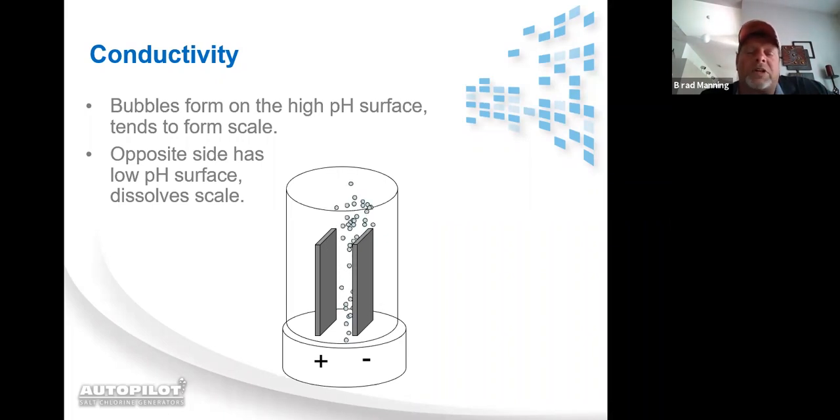So it is normal for a cell to get slightly calcified when manufacturing chlorine, like what you saw before I clicked the button that started the automation, that light white film. That's normal inside of a cell when it's manufacturing chlorine. That's also the reason why we have reversal periods. The reversal helps clean that off.